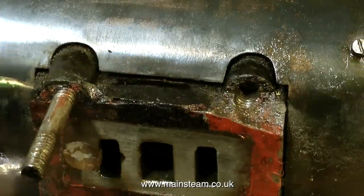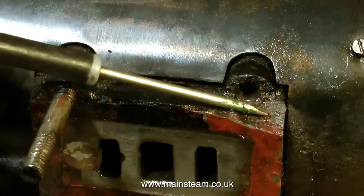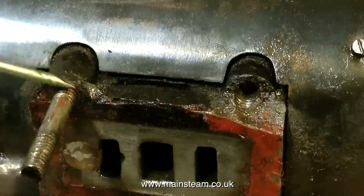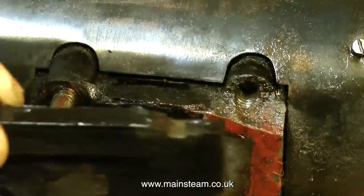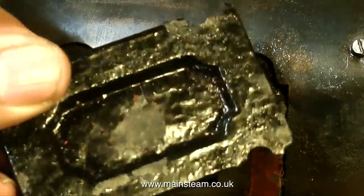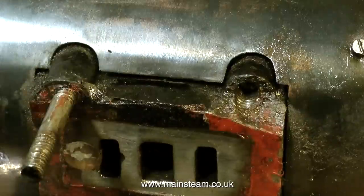Once again, it's very clear this is not my fault — you can even see some of the gasket compound on the broken part of the metal. I'm going to have to give this some thought, because it is a bit of a mess really, but it's possibly fixable. The problem with the steam chest cover is easily rectified — I just make a new one, using the existing one as a pattern. At this stage I really have to ask myself how far do I go with this; you will see as the rebuild develops.